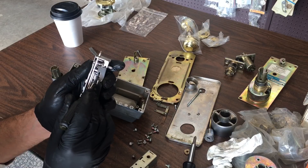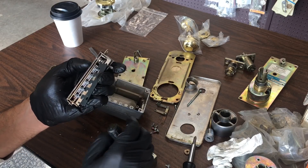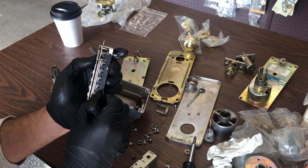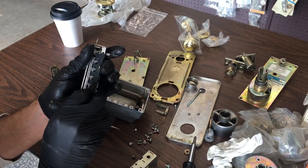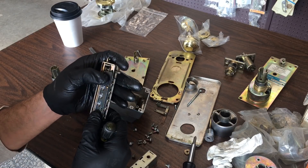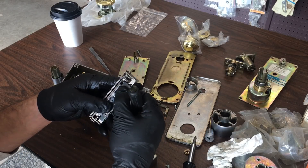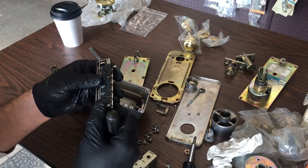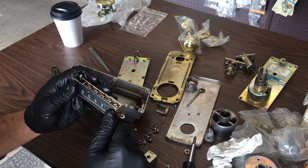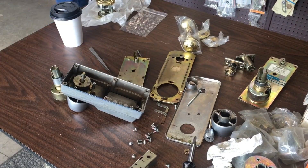Align all four of your gears now that they're free. You take your gears, line them all up like we have them here, and then snap this down. I don't know how this Happy Friday video turned into a full service of Simplex, but sorry about that — that will make up for the lack of videos I've been doing. Make sure it snaps in all the way. It feels gritty, so at this point I want to go ahead and hose this down with some lubricant — it feels gritty because it's not sitting in there correctly. I'm going to go grab some lubricant.